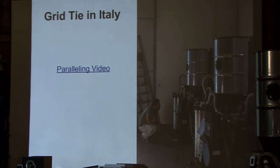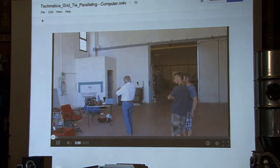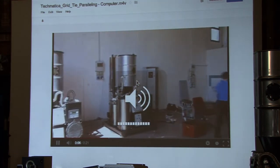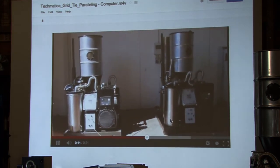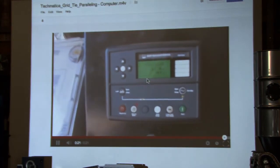The trip to Italy was about setting up the first prototypes of this system and proving it out. We did that with two power pallets, got them tuned and configured to 50 hertz, and got that running. Those were two 8610 units connected to grid, each running in parallel. In this case we were exporting about 11 kW back to grid.